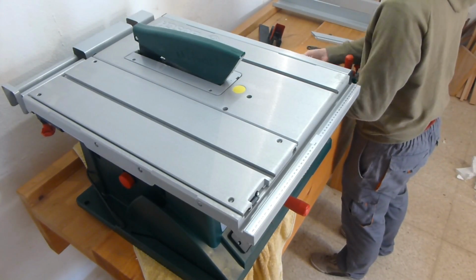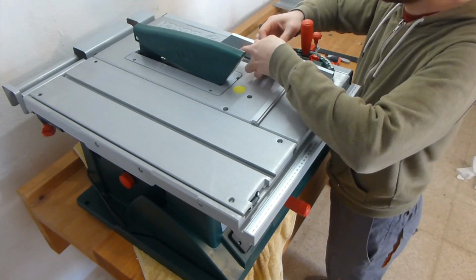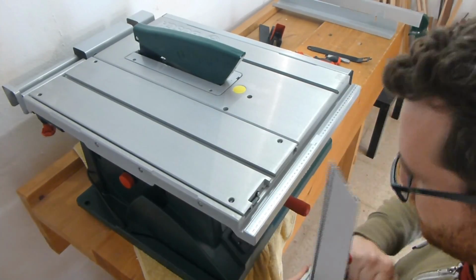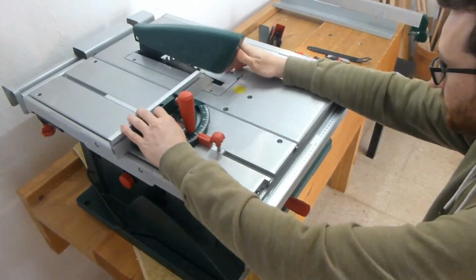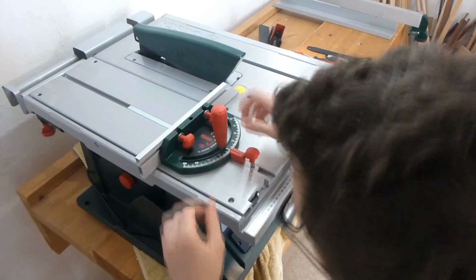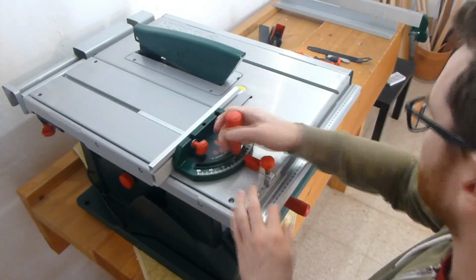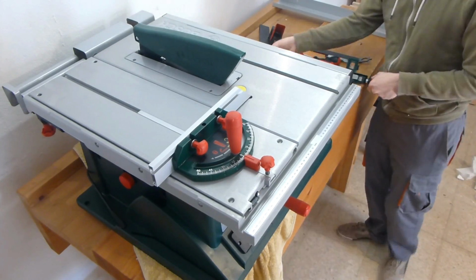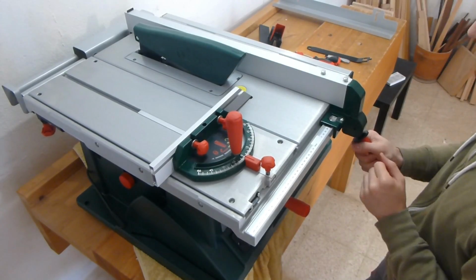One of the special features on this saw is the sliding table. This is pretty common on high-end saws in Europe, but in cheaper saws it feels more like a gimmick. However, I was pleasantly surprised. The sliding table has less slack than the miter gauge slot and is adjustable with 3 screws on the side. It feels good to use, although due to the table's size and the placement of the sliding mechanism, its uses are more limited than the more expensive, larger sliding table saws.